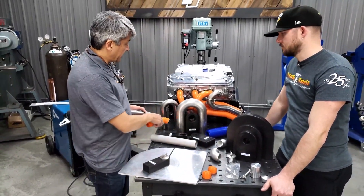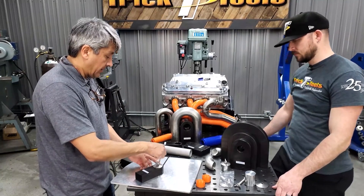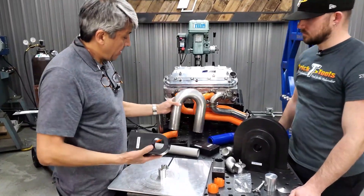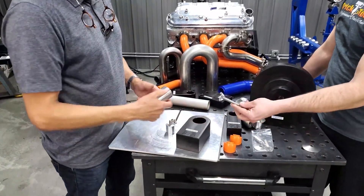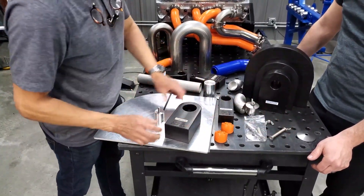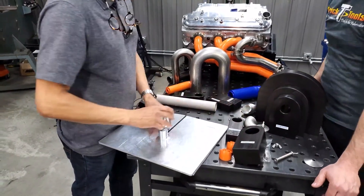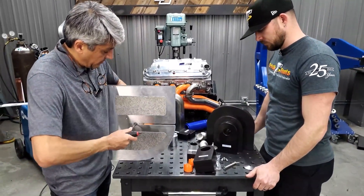This is for the FE series. If we need to switch to full exhaust, let's review the FE series. Because the spacers are bigger — obviously because we're using larger diameters — we're going to require a different stud that is taller. This will be the one for the FE, along with a longer bolt. The process is simply unscrewing this stud from the back and then replacing it with the new one with a longer bolt. The procedure is exactly the same. It's a very quick process to replace.